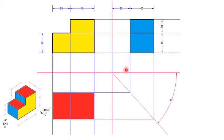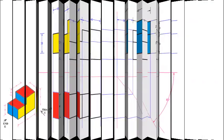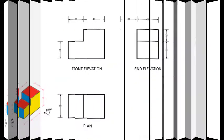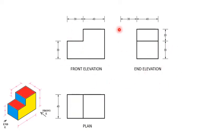Up to this point, we have finished the front elevation, end elevation, and plan. We need to highlight the plan so that everything is now in finished line. This is where you can do your dimensioning — you only dimension the diagram, not the construction. This is how you should present your diagram: the Cartesian plane and projection lines should be very thin and light so they are not visible. Your diagram should look like this, with the projection lines at the background — they are there but not visible. That's how your work should look. Thank you for watching.